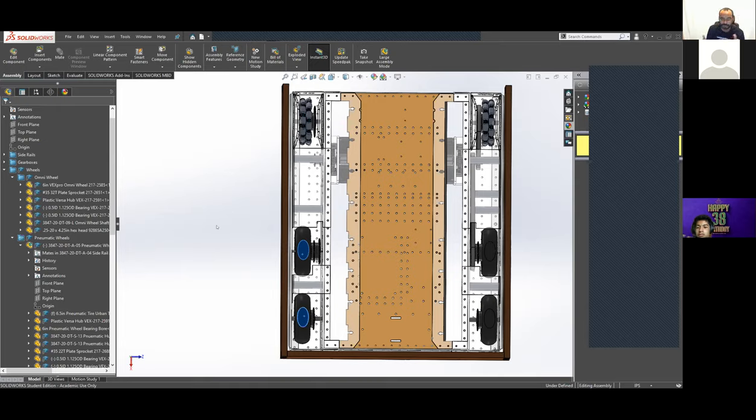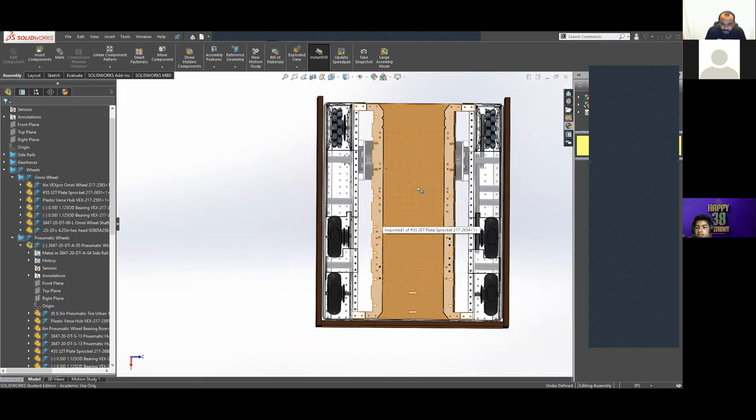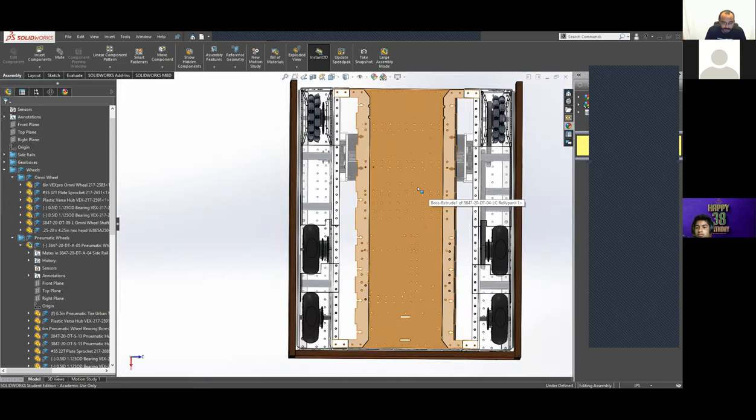By having the four traction wheels, you get some of the tracking advantages of a full traction drivetrain while still being able to spin out of some of the maneuvers, because you don't have any of that scrub on one side of your drivetrain. And it worked pretty well in testing. We were very happy, even when we were driving around doing things, until we started breaking omni wheels